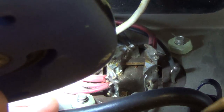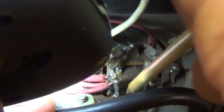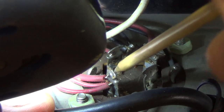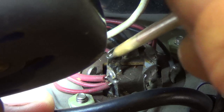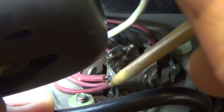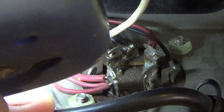And sure enough, when I look here up close, I can see that there's material extruding. The dielectric is coming up from inside the filter capacitor around the lead that was so disappointing on its ESR reading. The other three, I don't see any of that type of dielectric extrusion, but when one of them is doing it, it certainly makes you very suspicious of the other three.